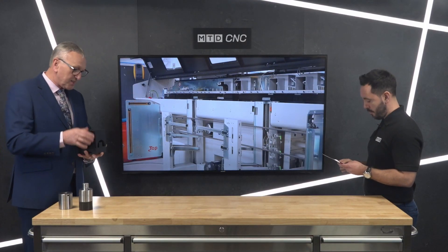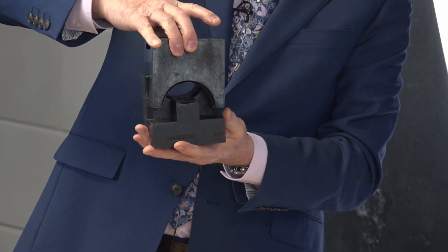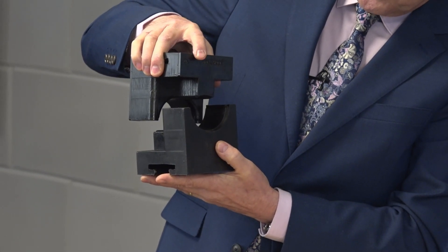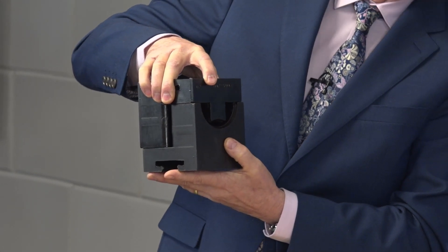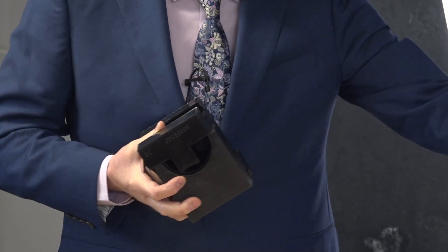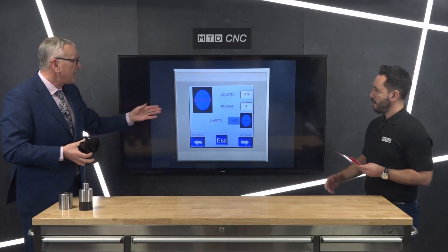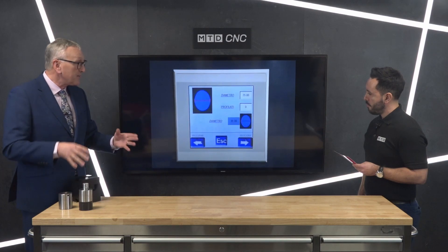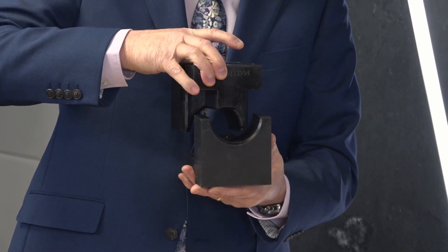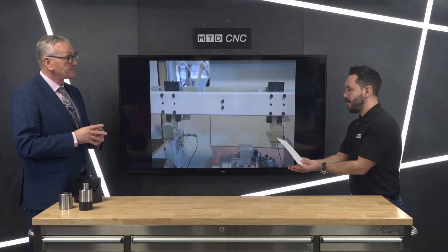You mentioned vibration — that is such a big feature. You've got six points of contact in the guide channel sets. These are the points of contact that run along the length of the bar feed. As they open and close — programmed depending upon the diameter of the bar — this 70 mm guide channel set opens to its maximum of 70 mm down to a minimum of around 10 millimetres. It's made from high-wearing vulcanite rubber, distributed along the length of the bar feed. Instructions for different diameters are easily given via the HMI, and once set, it is that simple.